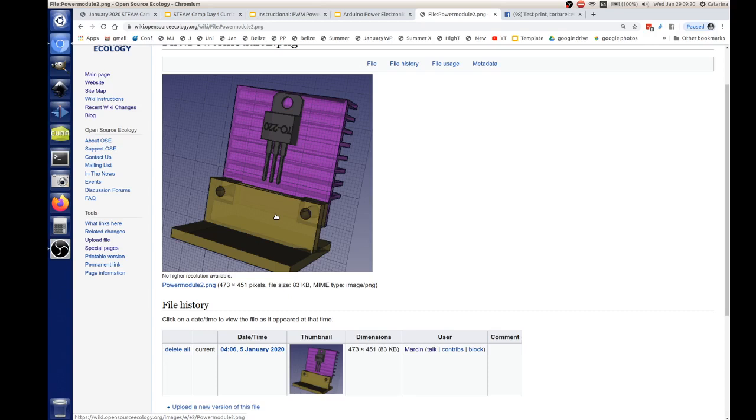If you get a welder, you're going to be dissipating with standard efficiency, say 90% efficiency. If you got a kilowatt, 95% efficiency means you're dissipating 50 watts. That's hotter than the soldering irons that we use. So you've got to get rid of that heat. A little fan and a heat sink does it.